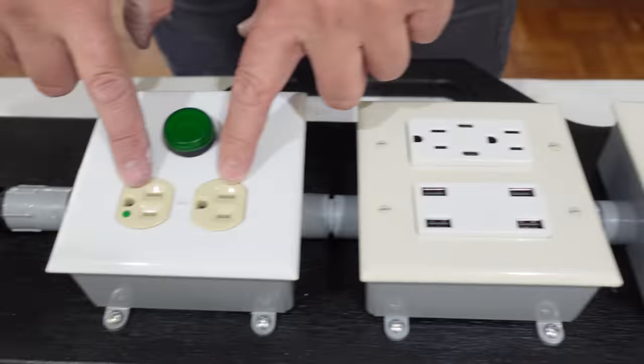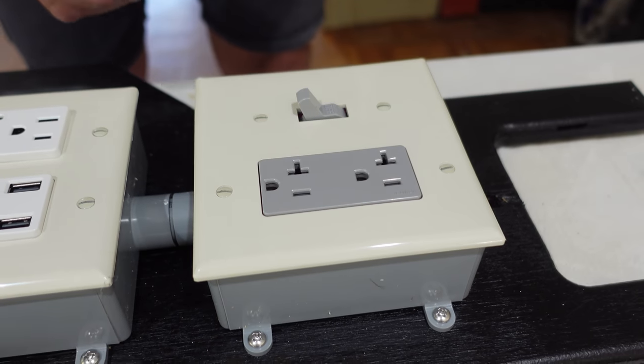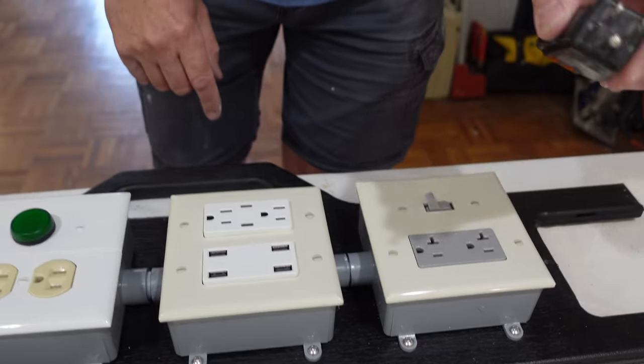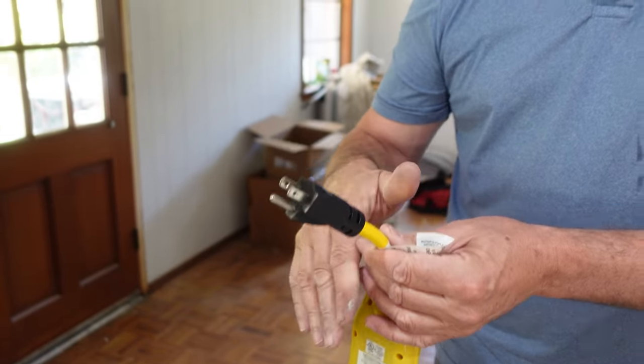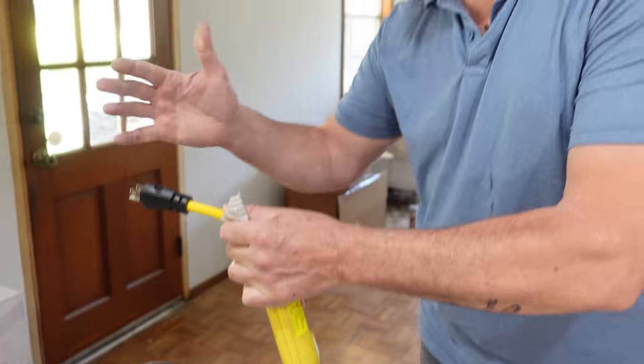Now I know we're going to get a few questions. Number one: can you mix the 20-amp receptacle and a 15-amp receptacle? In this case, yes we can, because it's a duplex 15-amp receptacle — two of them. If it was just a single, I could not mix them. Remember, the 20-amp receptacle is dual function — I can plug in a standard 15-amp cord or a 20-amp cord. What I can't do is put a 20-amp plug in there and plug this into a 15-amp receptacle on the wall and expect that circuit breaker to hold — it's going to do its job and trip. Can you plug in five or six tools without tripping the breaker? Let's head outside and check it out.